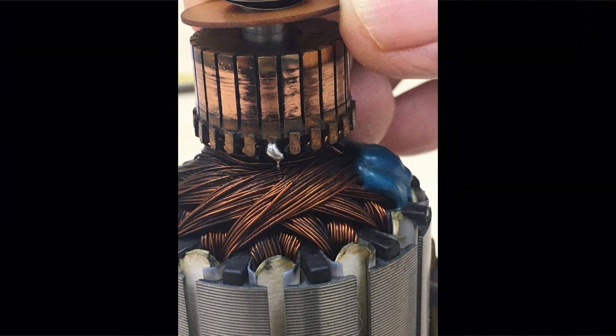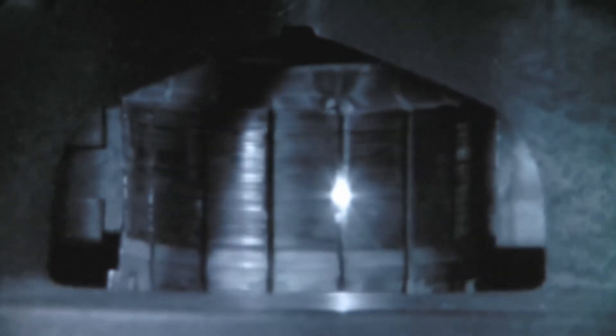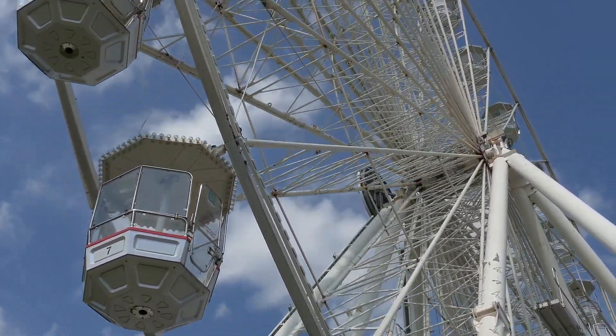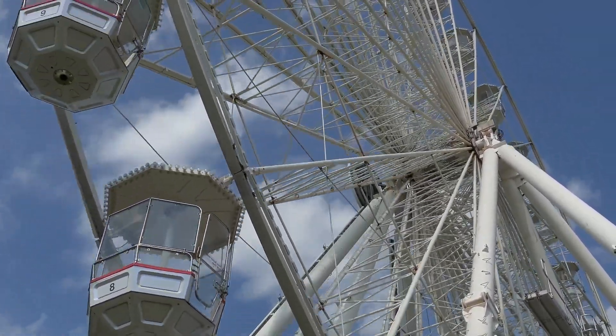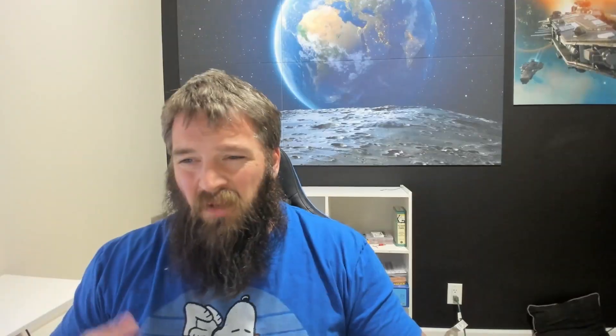When this happens, friction and noise is generated by the motor and that enters your system. Each commutator has a different section, and these sections ensure that polarity is only on specific segments of the motor. When the brush block crosses over these gaps, additional noise is created and generated into your system. So when voltage is applied, current flows through the motor and motion is created due to the opposing force with the stator magnet.